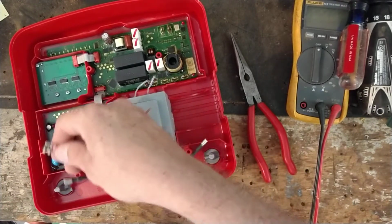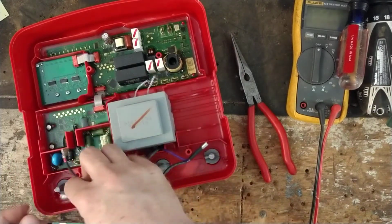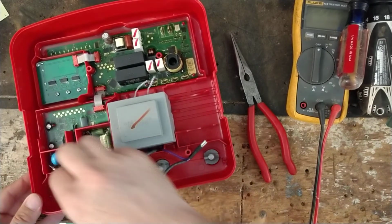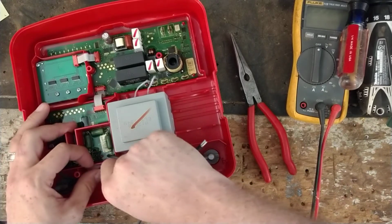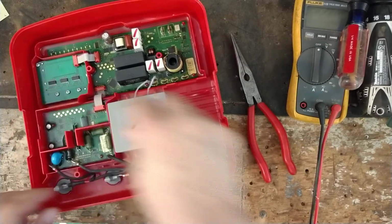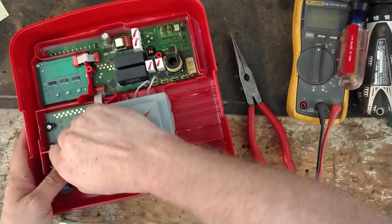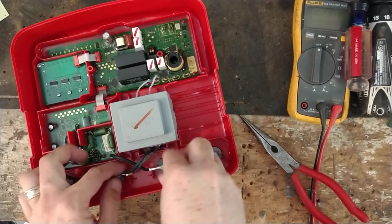Let's see. And then there's a dual wire here. It's red, and it goes over here. There are also a couple tabs right here. It goes right here, a little female sleeve, and then this one plugs on right there. Yellow wire for your half power goes right here. This purple wire for your ground is right there and plugs in over here. Like I said, this one is for the remote control. I'll pull this off real quick. Slide that up underneath there.